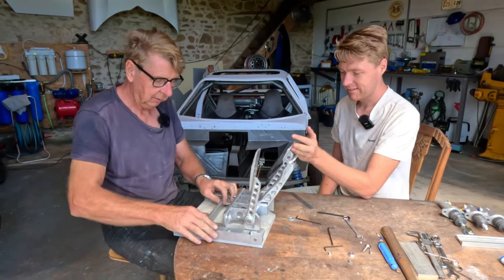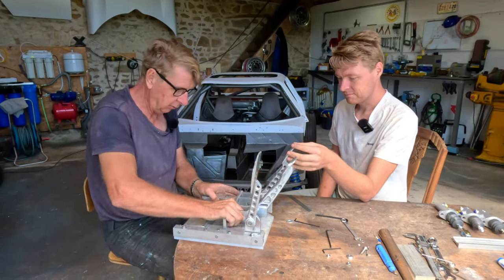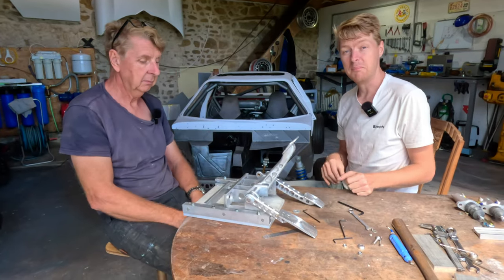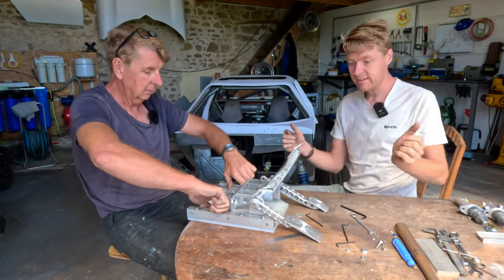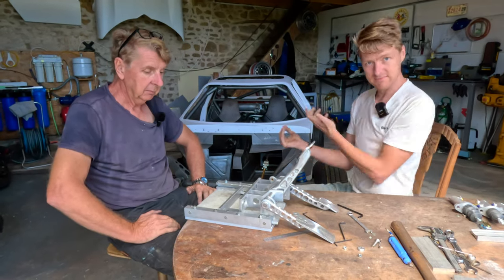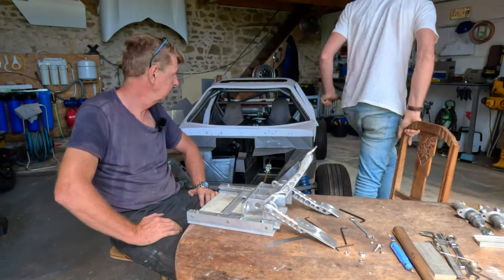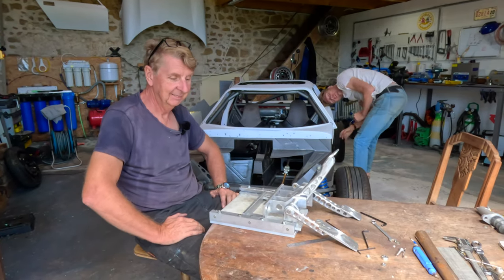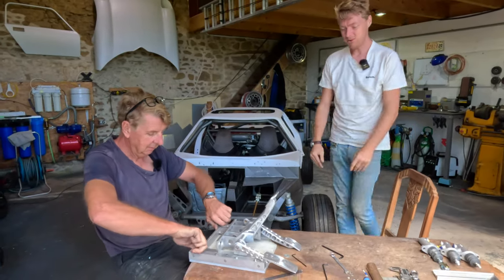And there's no sideways movement at all. It's not going like this. It's really got a grip. And what we'll do, we'll spring load it so that when a tiny person gets in the car and unlocks it, it will slide forward on its own. Because it's easier to push it back than it is to pull it forward. Obviously, I don't want Miriam in a car park with the door open, in a posh frock, trying to pull the pedal box forward. You want to get in, press the button, and it comes towards you, don't you? Yep.